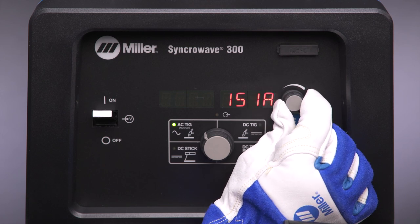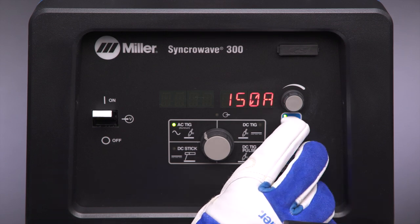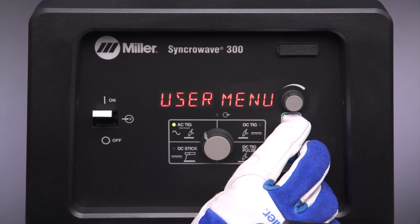Next, you'll need to program your arc start type, tungsten diameter, trigger type, and pre-flow timing. These parameters are located in your user menu. To get to the user menu, press and hold the menu button until the screen displays User Menu. Toggle through the menu options by tapping the menu button.